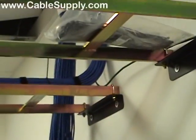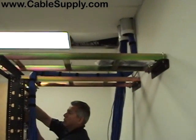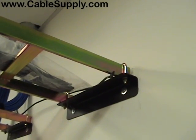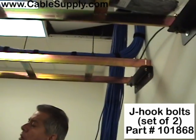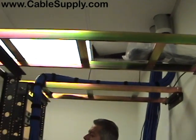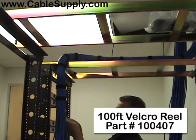While Patrick's punching down, notice how the relay racks are bolted to the floor and at the top they're also bolted to the crossmember. We have a ladder rack on top, bolted to the wall using an L bracket specifically designed for that, and J hooks that grab the ladder rack to run cable across — very nice and neat. Neatness counts in cabling.